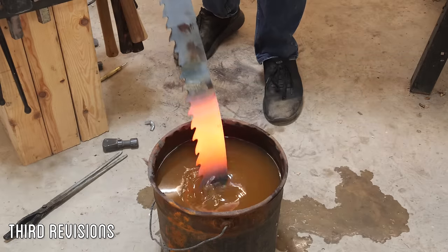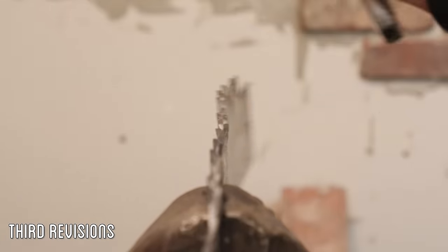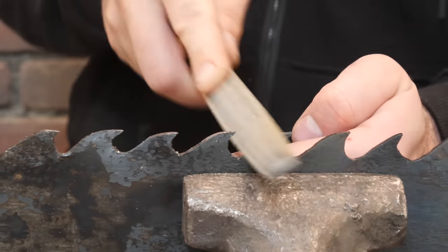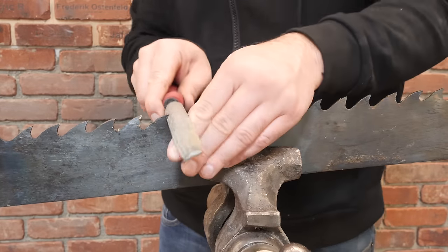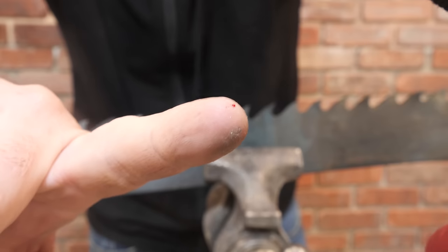To help improve the straightness of the cut and hopefully improve our cutting speed, I ground a new saw blade based on the saw blade I saw in Michigan, which is overall a lot thicker. This blade is a lot more aggressive. Hopefully I can capture enough torque to fully utilize it. Ow! I think it's sharp.